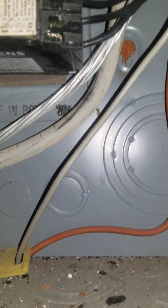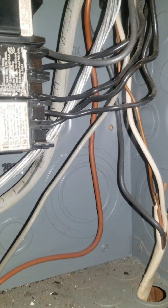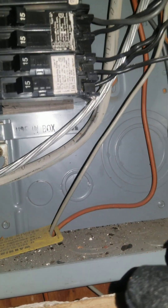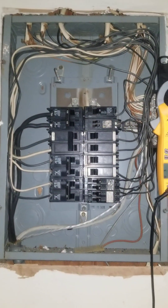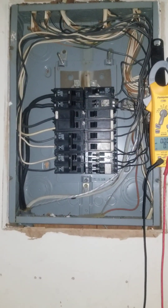But this is just very poor workmanship. At the very least, they could have moved this grounding wire down so it wouldn't be so close here. You also could have made sure this wire was tucked back safely. I will touch this to push it back, because if it rubs up against that panel — the panel is live — and the fact that this is not truly grounded, only somewhat accidentally grounded, that could be very bad. Please make sure you get a home inspection by a licensed electrician, because these things can cause damages you don't want to run into. Thanks a lot.